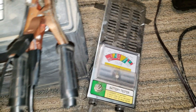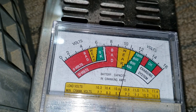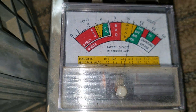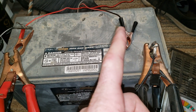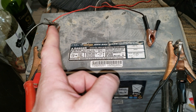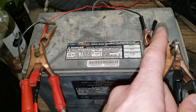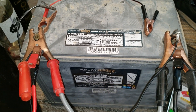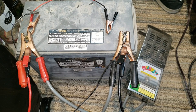It's day two — I've been charging it and then discharging it for a few minutes to bring it down, then charging for hours and hours, then discharging just a few minutes until the inverter shuts off, because it doesn't take long. Turned down to minimum and it's dropping really quickly — there's next to no usable capacity in this battery right now. The next thing I might do is drill out those vents and add maybe 50 milliliters of distilled water into each cell and try this again. I'm not sure how far I want to go, but if you guys are interested, let me know in the comments below. Thanks for watching.